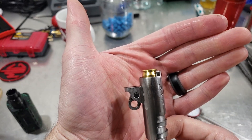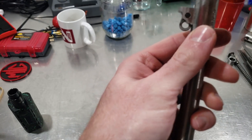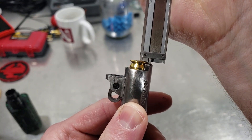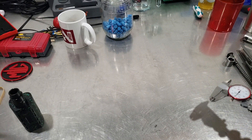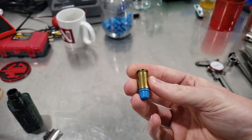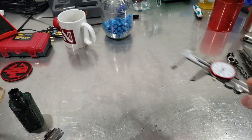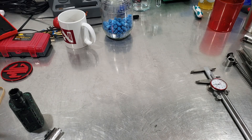Obviously that's too long. What I like to do is take my calipers and find out exactly how long it is. This is sticking up 49-50 thousandths past the hood of my barrel, so I know I have to be seated at least that much deeper in order to be touching the lands. I'm going to seat it 50 thousandths deeper. What do I have for a length here? 1.250 — so I need to be at 1.200.